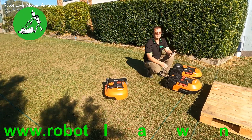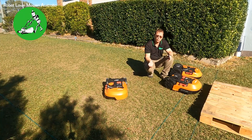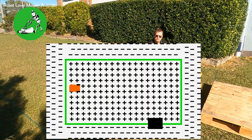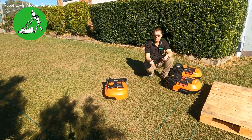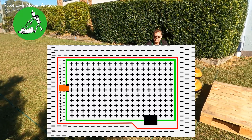Let me explain what that actually means. Normally with the Landroid boundary wire, you have a single wire. You turn on the base station and everything inside the boundary wire shows a positive signal, everything outside is negative. I'll put a picture on screen to show you. Now with this induction issue — where the signal is being inducted into a fence or another wire — it gets very confused. Everything inside the original Landroid wire is positive, and everything outside the secondary wire is negative.